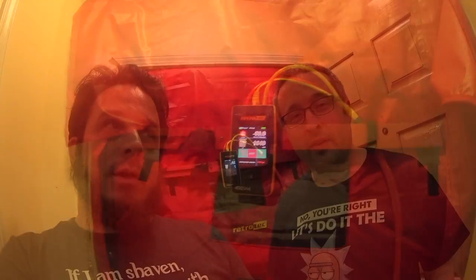Interesting. We ended up depressurizing the house and pressurizing the master — that was the only way we could get any numbers. That dropped my front door blower to 1,650 and change from 2,100, and it showed 550 roughly upstairs — leakage in the master suite by pressurizing the master suite and depressurizing the house overall. I'm on four hours of sleep trying to chew through this, but the numbers add up. However, it doesn't quite jive with what happens when you do a duct leakage to outside, so it's questionable.